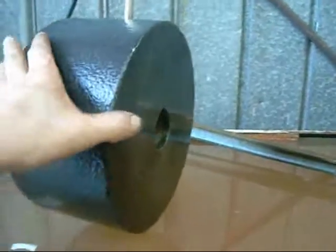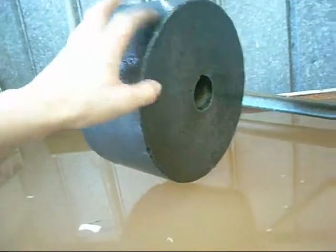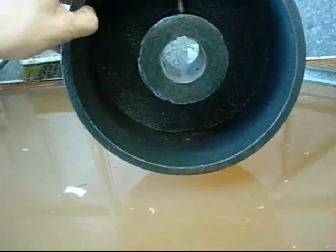I'm going to turn it on the lathe and take all that pitting off. The only trouble is I think it's slightly crowned to keep the flat belt on, so I'm going to have trouble reproducing that slight radius crown on it. But apart from that, this thing will clean up really nice.